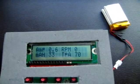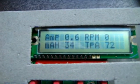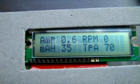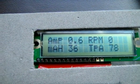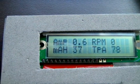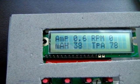So what I have is, I have an ice cube. So what I'll do is I'll put that at my thermistor on 3, 2, 1. So now it is in contact with it. Now you can see the temperature dropping as a result of the unit being close to the ice, and I'll pull it off, warm it up with my hands. You can see it's now up to, geez, about 85. And then putting the thermistor back onto the top of the ice, it slows down relatively quickly.